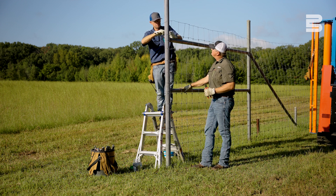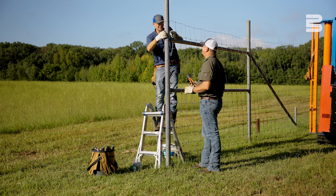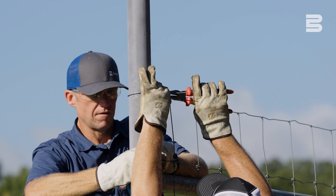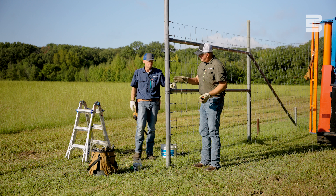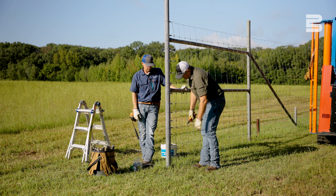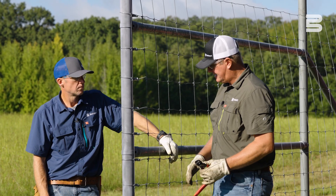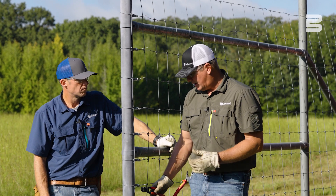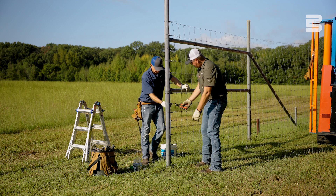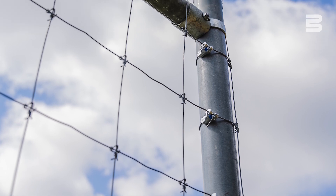This is one thing about high fence — you've got to have a ladder. You and I are pretty tall guys but we just can't seem to get there. It makes the end of the day better if you've got a ladder — you're not on your tippy toes all day. Now at this point, we'll look back, make sure our stays are running straight up our post and that we've got all the slack out. We'll be ready to go to make this pull. One way that I finish out these ends: you can go in and cut these square, but sometimes it leaves a little point sticking out. So I take my pliers and bend it under, then I can reach under and clip that wire off — now you've got a nice smooth termination. These T-clips are great.